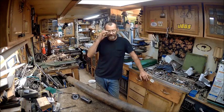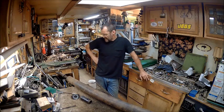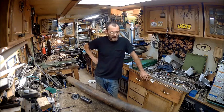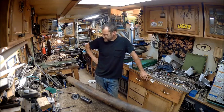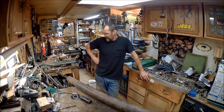all the plastic coating is worn off of the teeth on the splines on this drive shaft, so it actually fits looser than it would if it had the plastic coating. This one had that blue plastic coating on it, and it's off. None of it's on there anymore. The last two pieces fell off of it when I was cleaning it the last time, so it really only needs an inch.